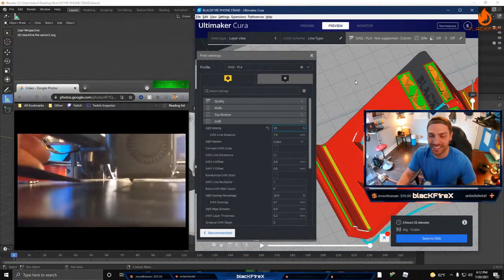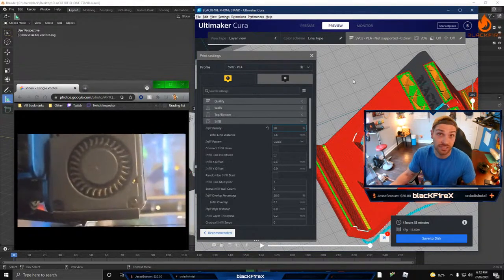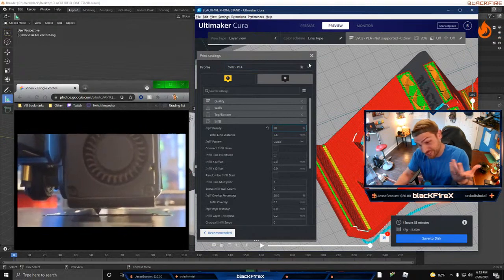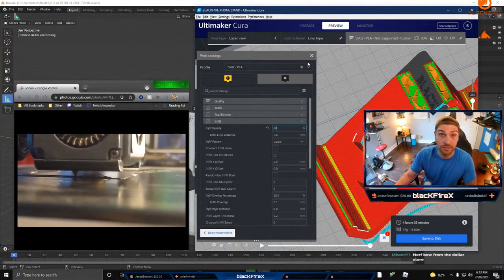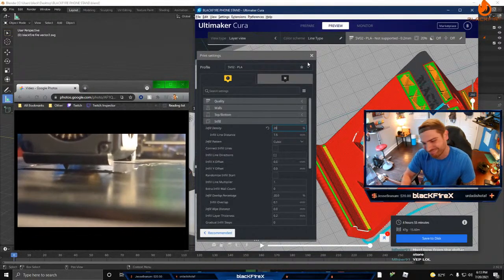But yeah, something like that, you're gonna want like a 35 to 50% infill. There are things I've done at 100% just because I wanted them to be solid. There's also different types of filament. You can do a nylon, a glass-filled nylon. Or no, I'm sorry, it was a carbon fiber-filled nylon. I've used carbon fiber-filled plastic.